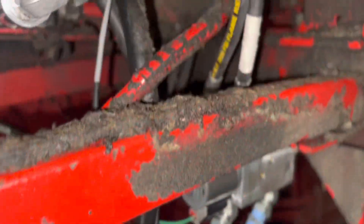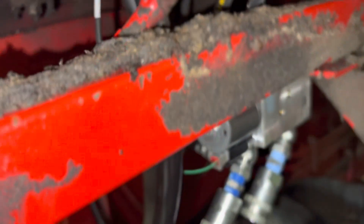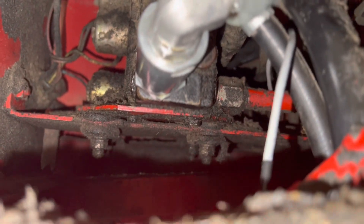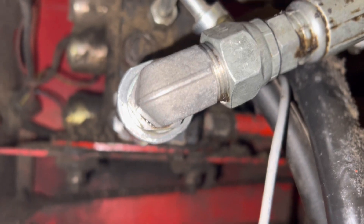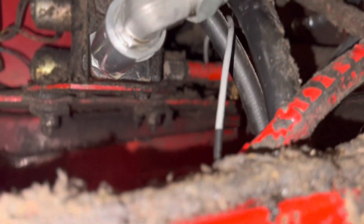I'll check for leaks quick. Had to tighten a couple hoses, so I made a bit of a mess, but we got them all tightened up and it's better now. The unload auger works great. I also had to rebuild this filter housing because the O-rings were leaking in there and it made a mess. I probably lost like three gallons of oil in this thing over the winter just sitting — it was that bad. That seems to be better now.